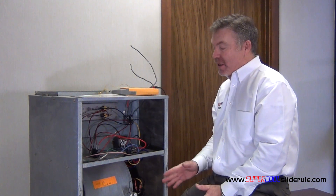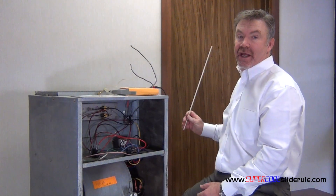To start with, remove your outer cover, turn your thermostat to emergency heat, and allow it to run for at least five minutes. Do not turn it to regular heat, because with the cover removed, air can bypass the coil, creating a head pressure that is far too high.